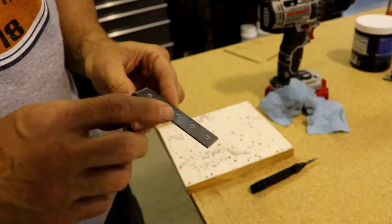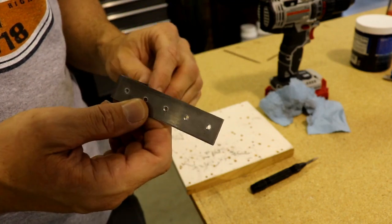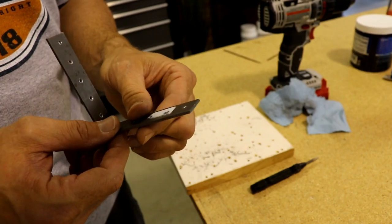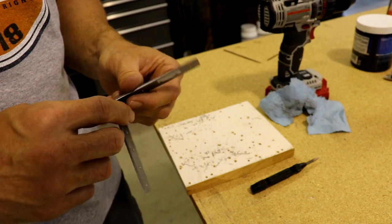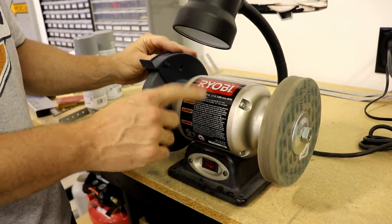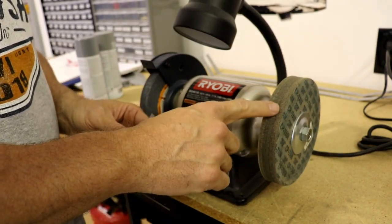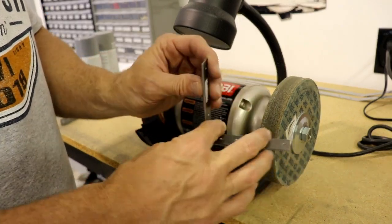The other thing I want to note is when you have these pieces in your hand, if you feel the edges, they're kind of rough from when they're cut or stamped or water cut or whatever. You also notice that the corners are 90-degree corners. Always, always round those corners — you just don't want sharp edges in your airplane. So I'm going to file the edges smooth and curve the edges on my grinding wheel. I have two different wheels: the grinding wheel to round off the corners, and a 3M Scotchbrite wheel, which you can get from aviation tool companies. This wheel is about $75, so they're not cheap, but they really come in handy. I'll use it to polish all the edges and smooth them out.